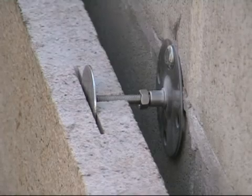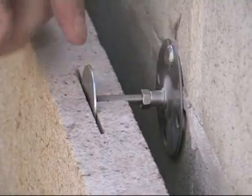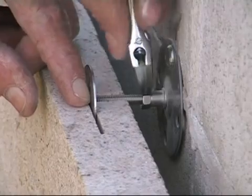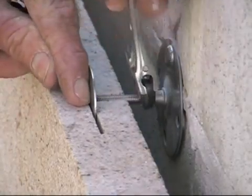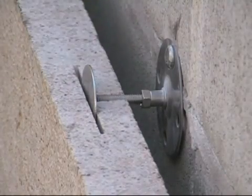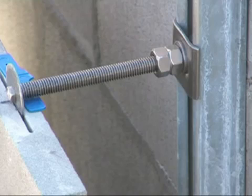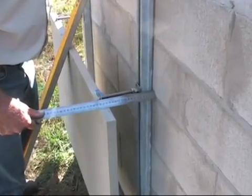All the clips are certified to carry a load that the engineer has stated in the test results, which are available on the website. But as always, you can't certify the ability of the installer. To keep moisture out of and from freezing in the cut, it is best to insert a bit of silicone into the joint before installing the StoneClip.